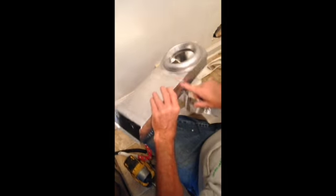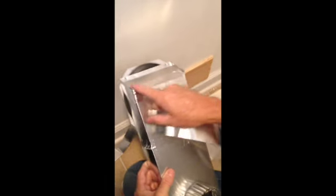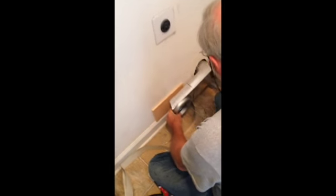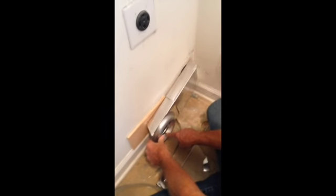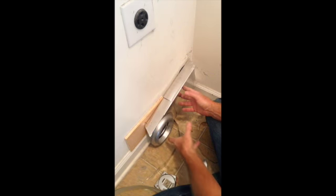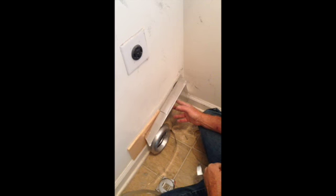All right, as you see folks, we have a seam here. I'm going to put foil tape around the seam — I tape up the possible leakage areas and everything. Then we're going to screw it in position to the wall and slide it in. The periscope's been cut down, shortened. We're going to come 11 and a quarter inches off that baseboard and 2 and a half inches to the bottom of this, because that's where the exhaust extender will place it and allow the dryer to engage that receiver straight in.